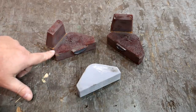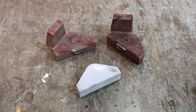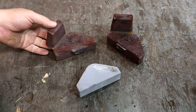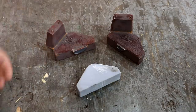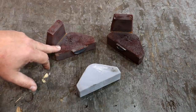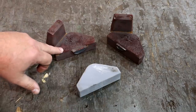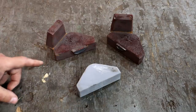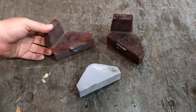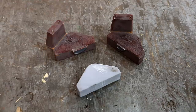Clark did wire wheel these. When I got them back, I did heat treat them. With cast iron, when you just get it directly from the foundry, it's going to have a lot of stresses inside the material. Back in the old days, foundries would let castings sit for about a year and the stresses would naturally work their way out. But there is a heat treat process to speed that up. I heated these up to 1375 degrees, held it at that temperature for two hours — the rule is about one hour per inch of thickness — then you drop the temperature down slowly, no more than 200 degrees per hour. So it's about a seven or eight hour process total.